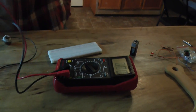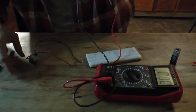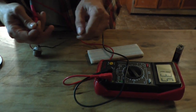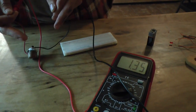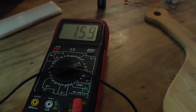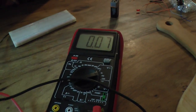This is about six months old, maybe a little bit more. I've got a meter right here on DC. The magnesium is going to be negative and the copper is going to be positive. See, that's already 1.3 volts. In time, as it draws, the crystals will push and push. This one I just made — I don't know the voltage but let's check it. It's 1.5 volts and it's only been sitting there about 10-15 minutes. As it cools down the voltage is going to drop.